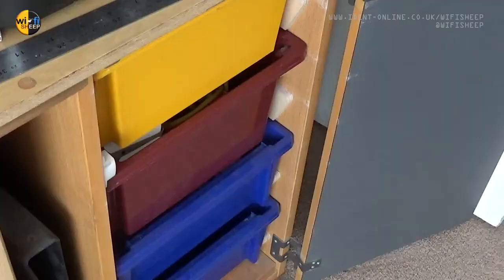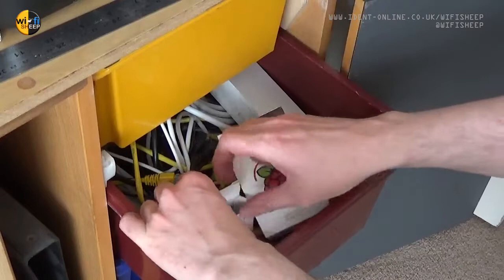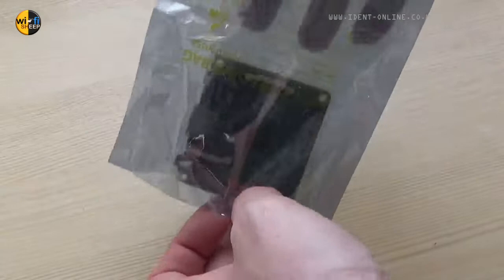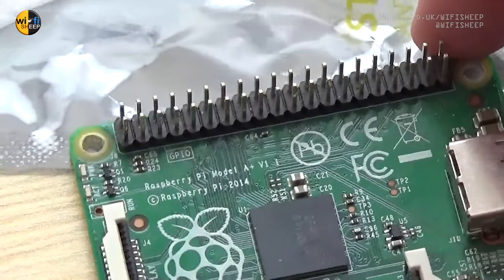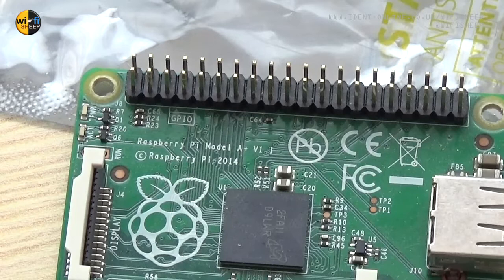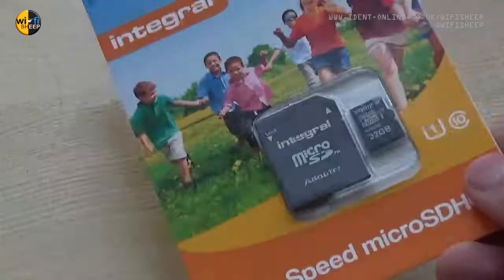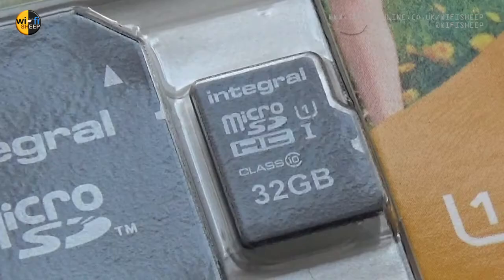Pi Tube Direct requires a Raspberry Pi board to act as the main co-processor. The natural choice for this is the Pi Zero, but I do have a few older spare Pi boards somewhere. This 2014 A-plus board will do nicely. Even with its limited 256MB of RAM and slower 700MHz single-core ARM processor, this A-plus will be more than capable of handling the CoPro requirements, plus it has the added advantage of having a 40-pin GPIO header already installed. The A-plus still requires a microSD card — this 32GB card is admittedly overkill, as you can get away with as little as 2GB, but it'll do for now.